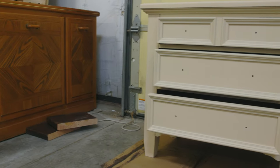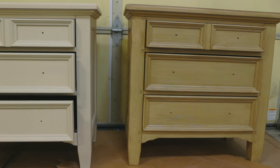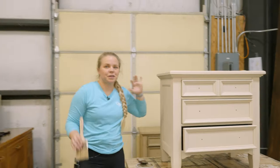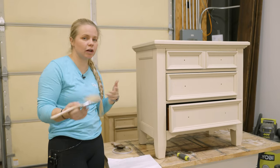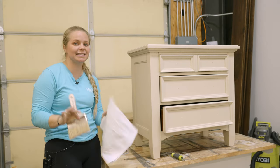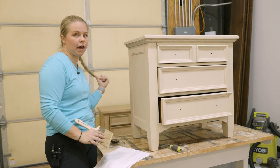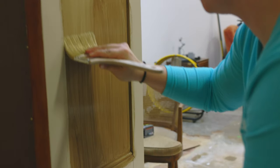The first one is done — I love it! It's definitely got that Pottery Barn vibe going on, which is the look I was going for. It's a really popular look, and nightstands are super popular too. Now that I've got one under my belt, I've learned a couple of things: it dries pretty quick so you want to work quickly, and the paper towel to wipe off the glaze between swipes is key. If you don't wipe the brush, it'll keep adding glaze and the finish won't be consistent — lighter where you start and darker as you go.